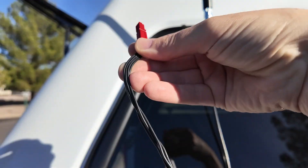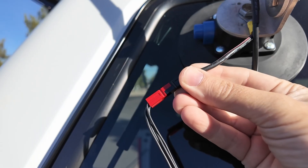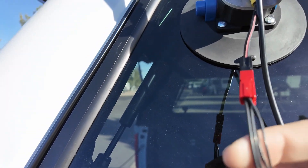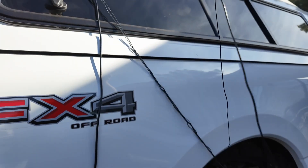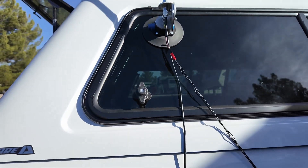I've got what I think are 10-meter radials and I can attach them right there to that Anderson power pole connection. This is not power — just radials. Out of the back end I get four wires, though one broke a while ago. I can spread them out in different directions going away from the truck to help pull my signal in one direction or another. This is kind of like a POTA performer setup — elevated vertical with radials — and I can get them tuned per band, fold them back, or have multiple radials, whatever I want.